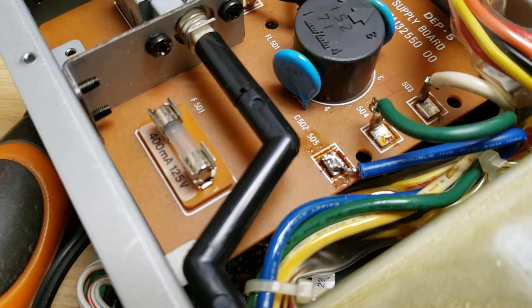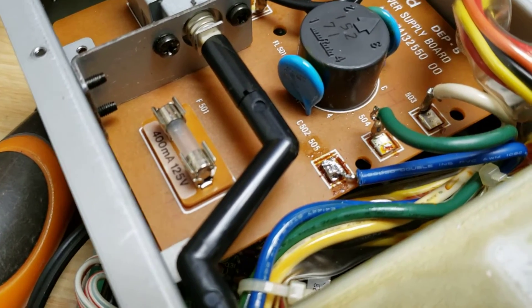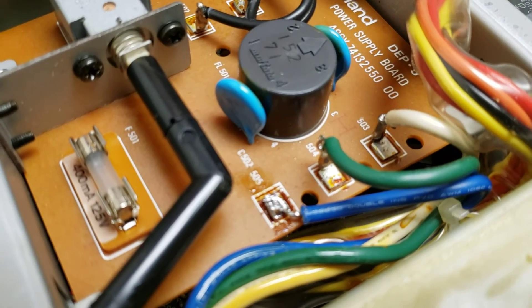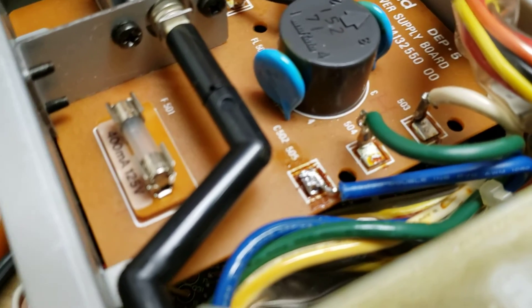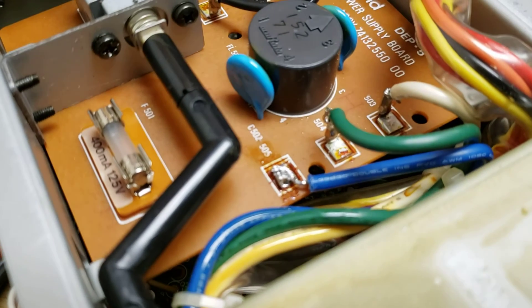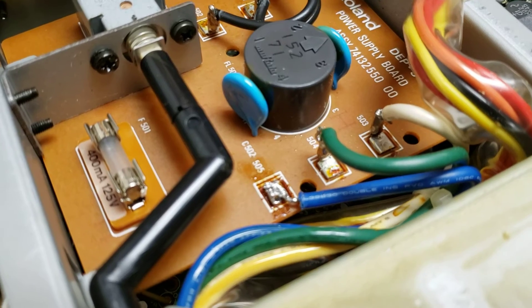This one doesn't look good because the connector on the power input board snapped as soon as I desoldered the wires. But that green wire and that red one — yours may differ, you have to measure it with a multimeter to work out which is which. The blue wire is the input on the transformer for 100 volts, and the green is for 120 or 117.